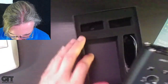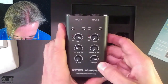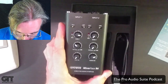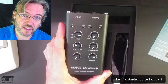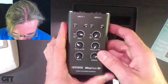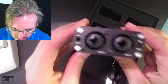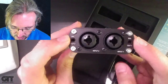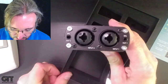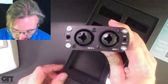Here's the unit itself — I've already used this thing. I used it to record a podcast a few weeks ago called The Pro Audio Suite with great success. You've got two combo inputs that accept XLR or quarter inch. Alongside them are two balanced outputs. Because the unit is so small, the balanced outputs are on mini jacks — but a stereo tip-ring-sleeve mini jack can be adapted to a balanced quarter inch or XLR depending on what gear you're plugging into.